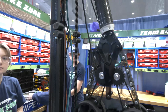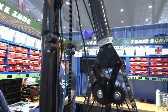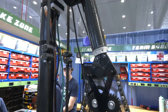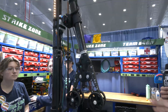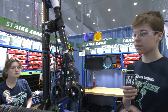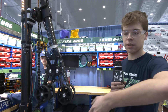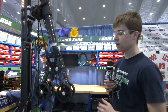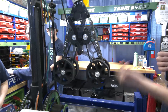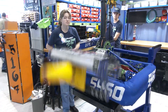One other thing I want to ask about is this belt here — there's almost like a little bit of a kink to it. Do you have any slippage or is it an intentional design? The looser belt was a little bit intentional because we found when we had the belt tighter, these wheels would actually start pulling the game piece and slipping against it, leaving marks on cones. So now if we start pulling the game piece in too much, the belt will just slip before the wheels start to tear apart the cones or the cubes.